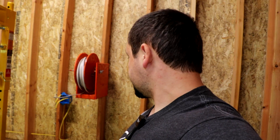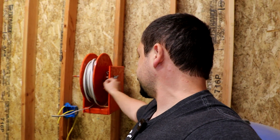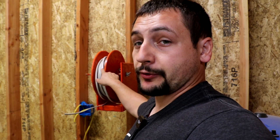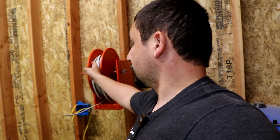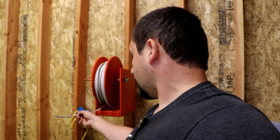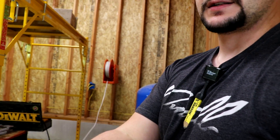What I've built behind me here is just a bunch of scrap plywood and two-by-sixes I had left over. I did go get a couple of wing nuts and a piece of all-thread. Inside here is a piece of six-inch sewer pipe. I cut some circles out with my router, routered some grooves on the inside so the sewer pipe would recess — and it's just the right size for the wire on spools to fit in here. When you pull on this, it unspools flat, which is important because if you don't do that, it twists, and it's a really big pain to install.